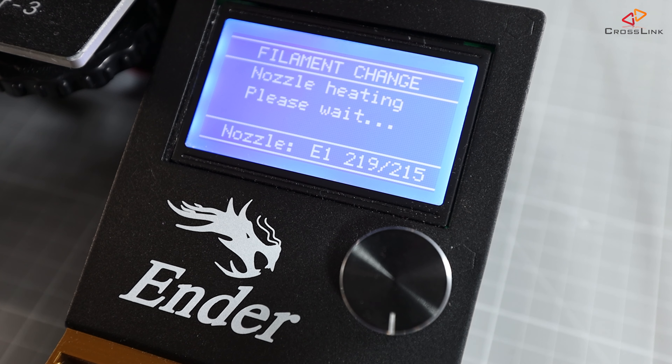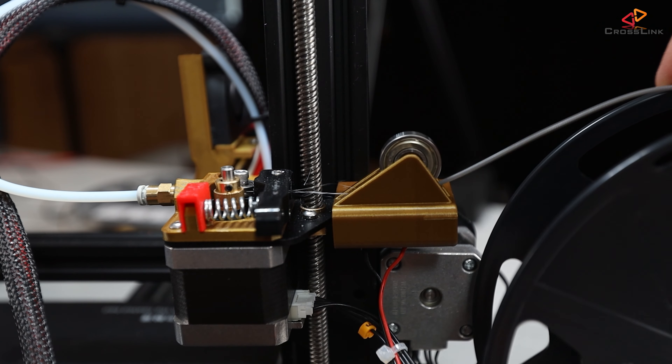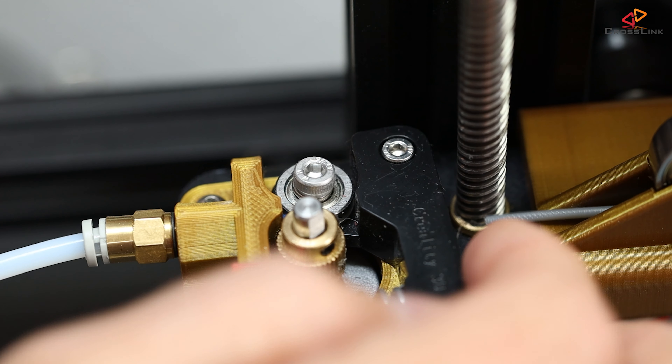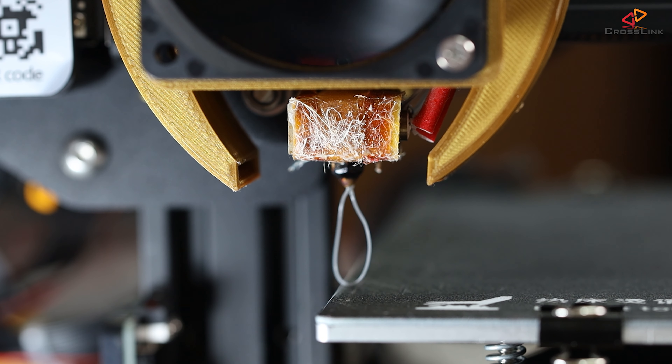Remember, if you'd like to change filament types — like from PLA to ABS or from ABS back to PLA — always select the temperature for the material that requires the higher temperature. So the nozzle is heating up now, and once it's reached the final temperature, the filament unloading will start. The extruder motor is pulling out the filament. Once it's completely out, the nozzle will be kept at temperature for a little longer, probably about 20-30 seconds. Don't be surprised if after a while the display changes from 'insert filament and push button' to 'press button to heat nozzle' — you'll have to push the button and wait again until the nozzle reaches temperature. Then insert the new filament and push the control button to confirm and start loading. Once the new filament is coming out of the nozzle, you may push the button to stop extrusion, or just wait until it stops on its own, since there is a limit in the firmware for that final extrusion length.